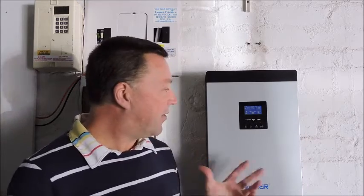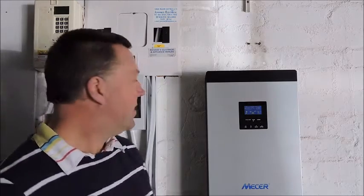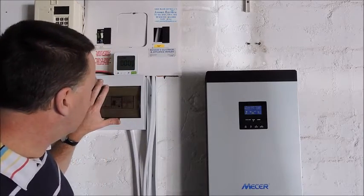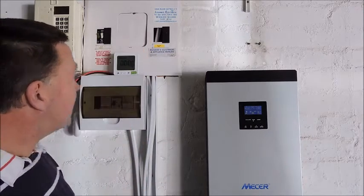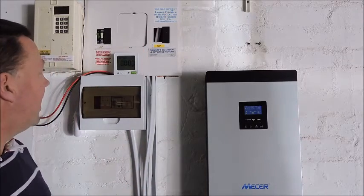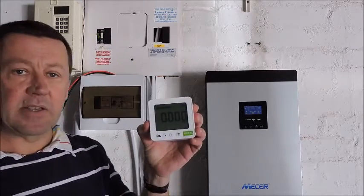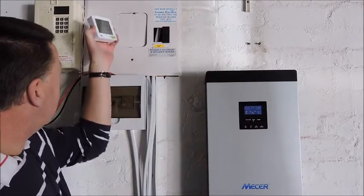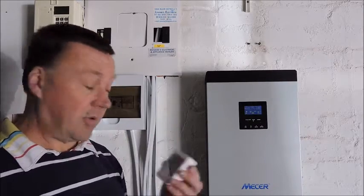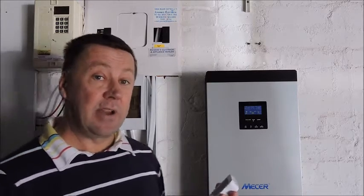At this point, about three quarters of the way through the installation — as you can see, still some cables hanging out here. I've fitted a DB sub-board just to cope with isolation. What I do recommend is when you start off, buy yourself one of these consumer meters — this one is Efergy. Plug it into the DB board and monitor your consumption for a couple of months before you start. You're really going to get a good idea of how much power you really need and what you can afford to do without.